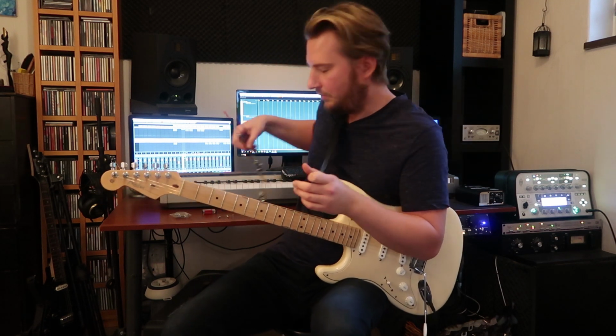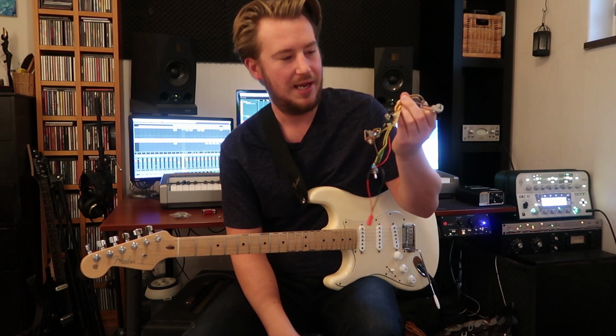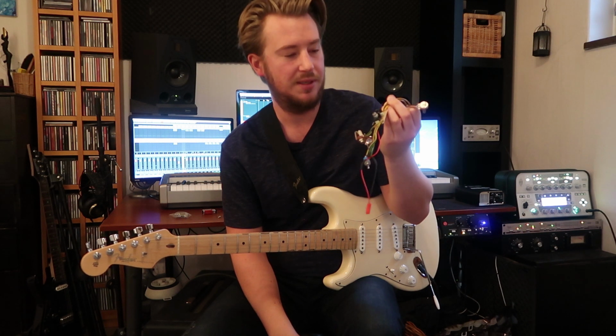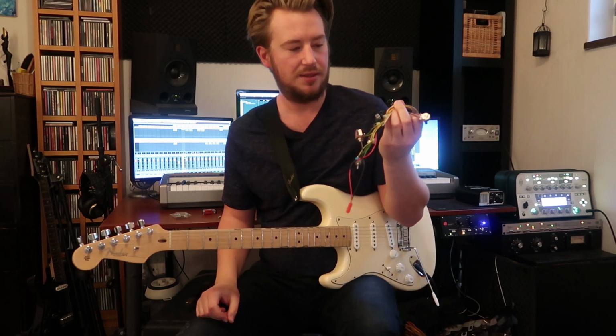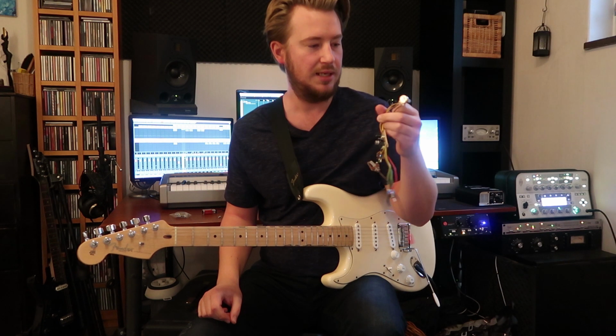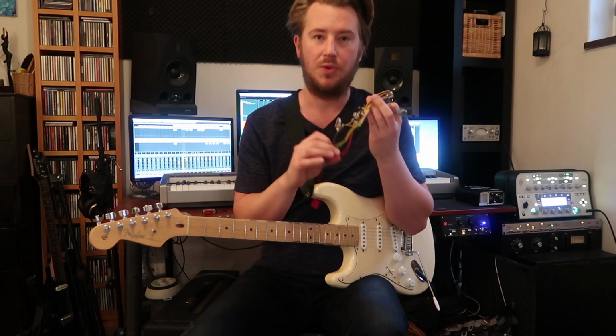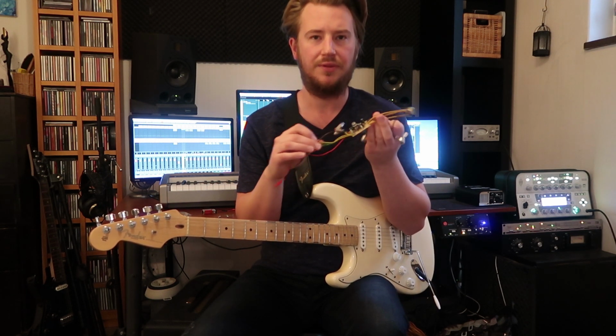And so I found a basic schematic of, I guess, a clone of a clone of a clone. So it's basically like a Rangemaster, but it's been modified some. It's very simple. It's this right here, and it's just a bunch of wires and a board. It has a transistor, which is supposed to be a germanium transistor. It has some caps and a few resistors and some biasing pots, and ins and outs, tone and volume. So I'm going to be building this real quick in this video, and we'll try some different options.